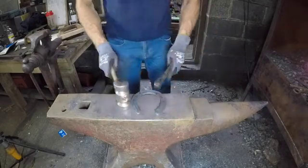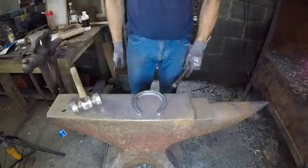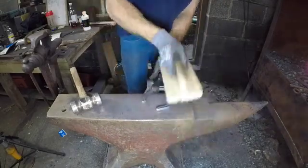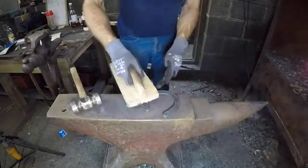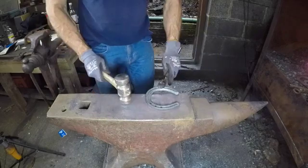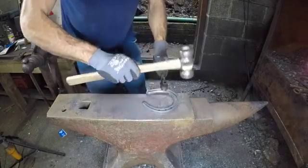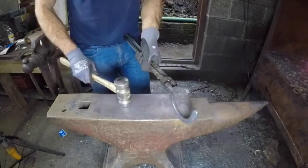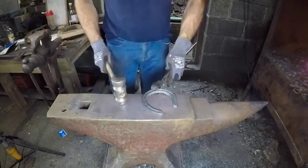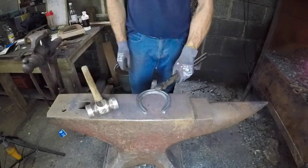I'm levelling the shoe, making sure it's nice and flat and level, working the outside edge of this piece of concave steel. You learn as you're working with concave that you can hit certain areas and it accepts it quite easily, but if you hit other areas they buckle, distort and crush very quickly. Give the shoe a brush and one last adjustment for the flat level. It's nice to flatten and level concave shoes when they're cooling off, because you do less damage to the actual concave section. Constantly checking the work you're doing and reassessing — you're looking for this feedback loop: what did that blow do? What did I want to achieve? How can I achieve it? Try that, assess and keep working around in this feedback loop.